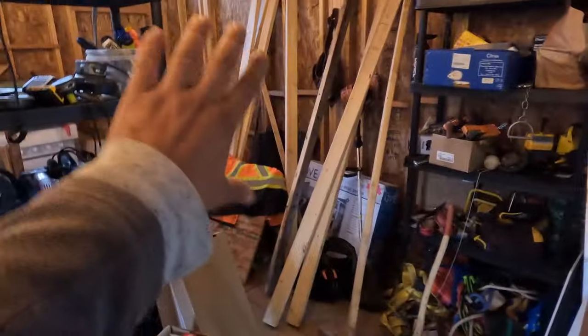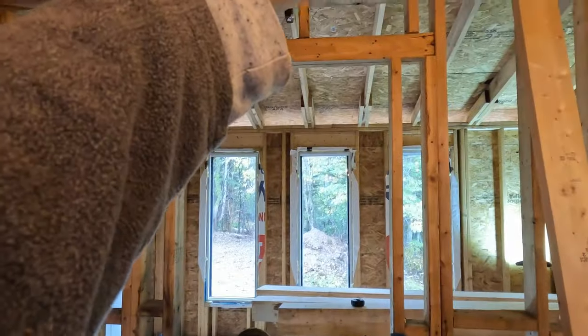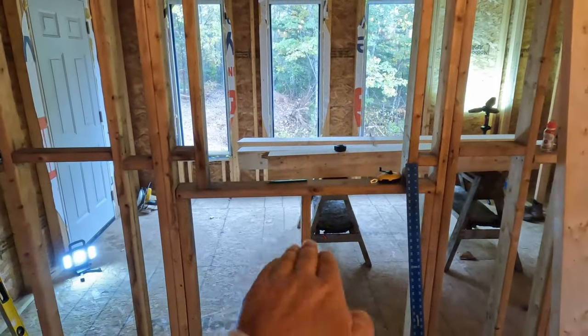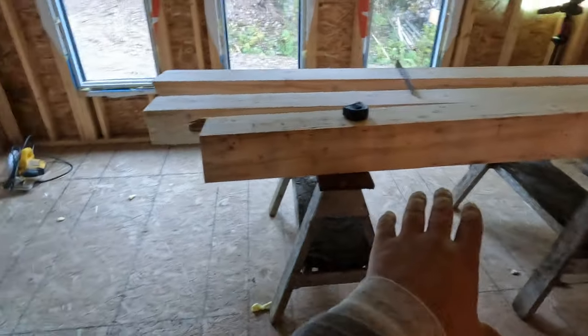this is all going to be kitchen in here, and then we're going to put an island in here, excuse the mess. If we put the wood stove here, it would take up way too much space of the kitchen, and the chimney would have to run through upstairs, through our daughter's room, and take up space there. By opening this wall up like this, we can inset the stove further into the mudroom. It helps because we're going to have coat hangers all through here, and we'll be able to put our boots out. This is going to be tiled, which means we'll be able to dry all our farm gear, all our clothes, everything like that will dry out real nice.